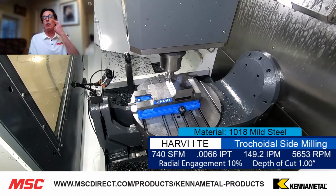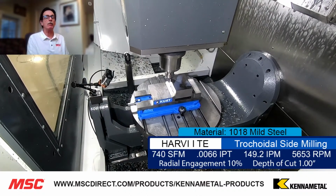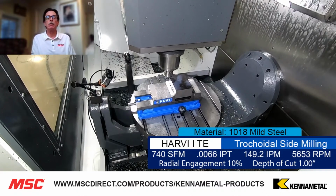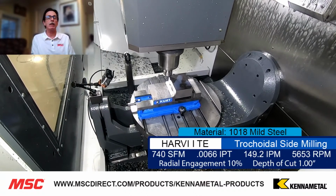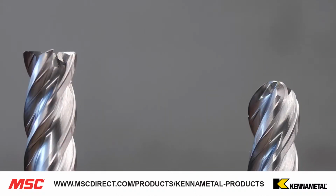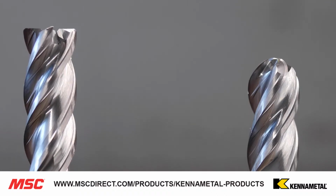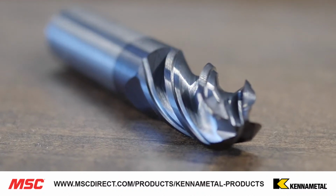Those ripples allow coolant right to the edge, and you have an extreme increase in tool life and the ability to really push that tool faster speed-wise because you're not going to create as much heat. Very versatile cutter, very successful out there. I don't know anyone who's tried it that hasn't changed over to it or really utilized it. So it's a game changer in the industry. Absolutely going to drive our competitors nuts for what this thing can do.